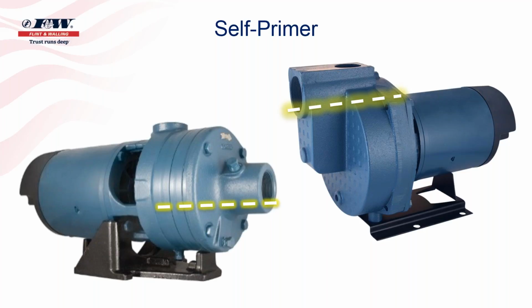On the other hand, with a self-priming pump, if that same thing should occur, you can see because that inlet is so much higher that if that water were to drain down and that system drain down, it cannot go below the bottom portion of the inlet on that self-primer. And again, with the dashed or dotted line going across there representing the water level in the case of a complete system drain down, that impeller that's behind the pump housing there would still be fully submerged in water, and there's a better than average chance that even though you might have lost system pressure, if you power that self-primer back up, because that impeller is in water, it will create the suction and the pump will go right back on stream for you. Therefore, they're referred to as self-primers because they tend to keep their prime in certain adverse conditions versus the centrifugals.